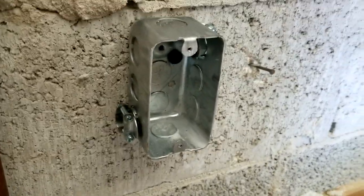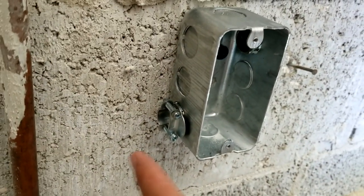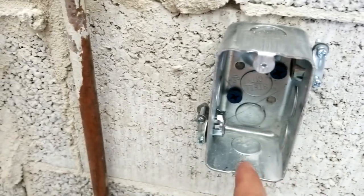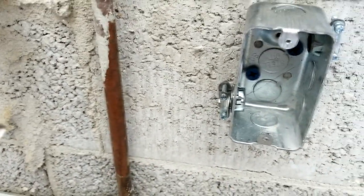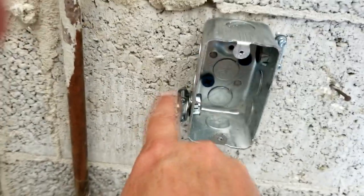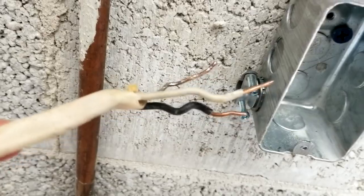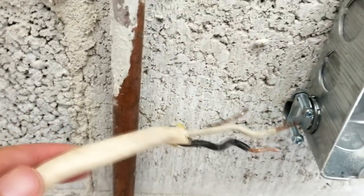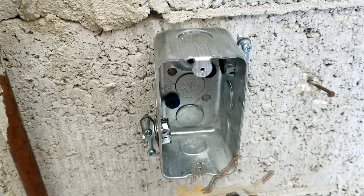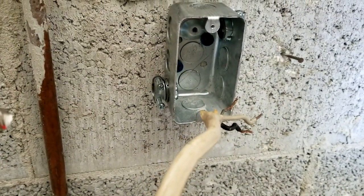We've already put the can up on the wall here, so this is our outlet box. I've already put a Romex connector on each side, and I used snap-ins here — I kind of like using these sometimes, it's a lot easier than dealing with those nuts. These connectors are needed to provide strain relief for the Romex cable. This is the cable for the garbage disposal; it will go right in there and come through to the inside, and then we'll connect it up to the back of our outlet.